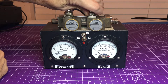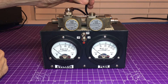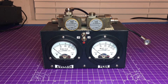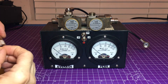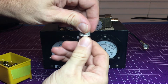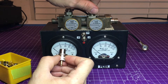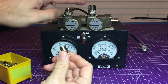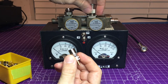I looked in some videos, and yeah, you can actually use a PL-259 — BBI said that, and a couple others said the same — because it threads the same way. You actually have to shave the center down, but you could rework it because those things are a pain. The threading is exact, so you could shave down your center connector. But I just wanted to use what I had available.